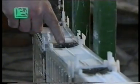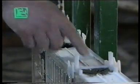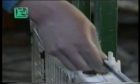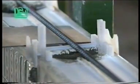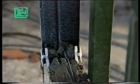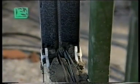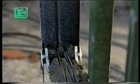Notice that the spacers can be placed in 2 positions. It is in fact necessary to alternate them to give support to the horizontal reinforcing rod, so preventing it from coming into contact with and possibly damaging the glass bricks. Other than the 6 millimeter rod, 2 curved 4 millimeter anchoring rods are placed at each end of the wall, hooked to the rods which were fixed to the uprights during the preparatory phase.